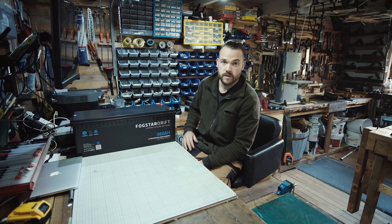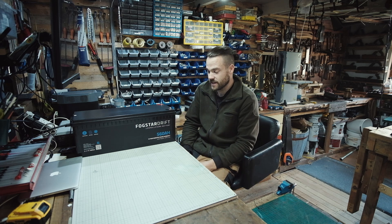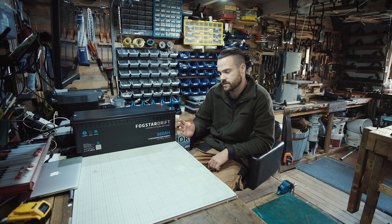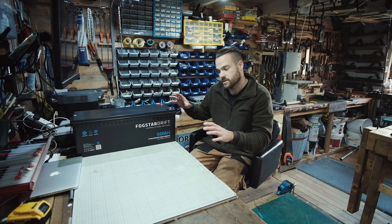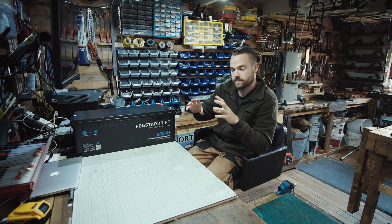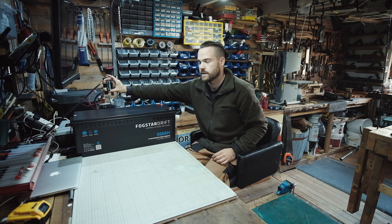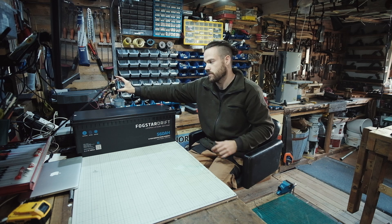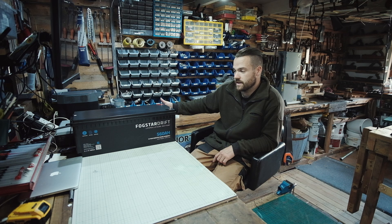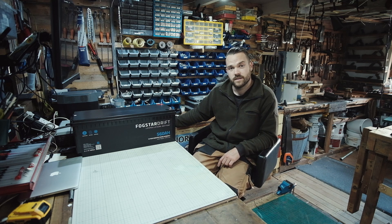Obviously there's only so much I can say about that battery because it's been connected for one day. I'm not going to bullshit you — I've got to test it and play with it. However, after using these for the last year and a half, I can confidently recommend them because they've been solid. We had one issue with them running in series — on the phone app, the BMS readings were slightly off from each other, so you'd get different readings rather than a joined reading. But using the shunt, as you should, once that was calibrated right with the right settings, it didn't matter. That was like the only teething problem. Other than that, they've been solid.